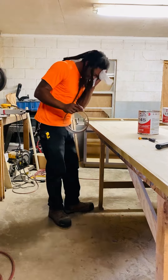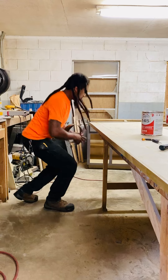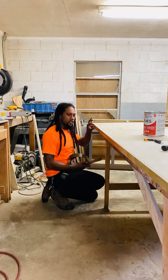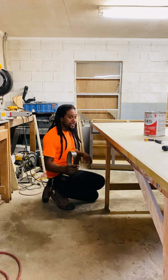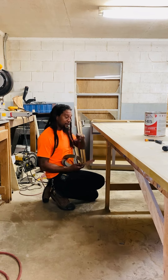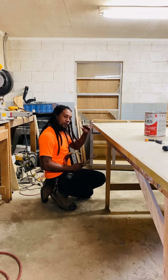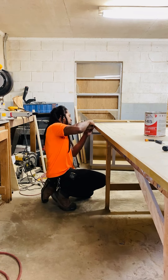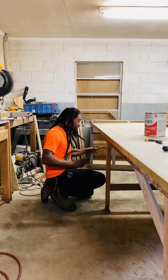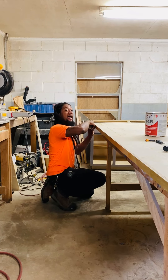I'm going to start that. What I have here is one and a half inches; my laminate is one and three quarters inches, which leaves me a quarter inch of overhang to come back with the router and trim it off. So I'm going to start at the bottom — you want to be flush with the bottom — and you want your overhang on top. Also, you want a little bit more on each end to hang over the edge, so I'm going to go about a quarter inch over the edge — I'm eyeballing it.